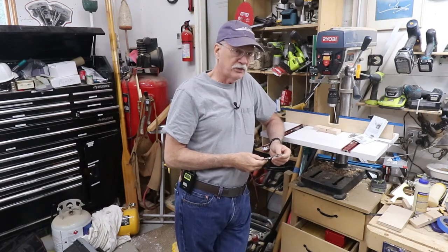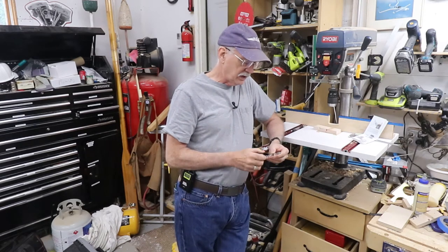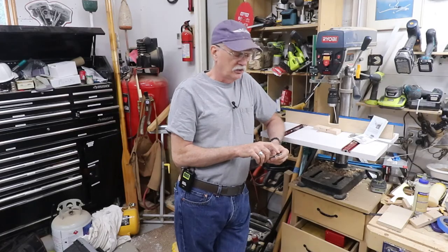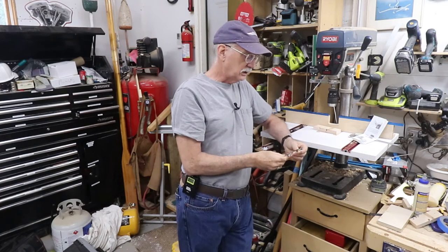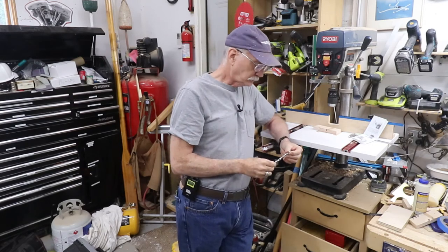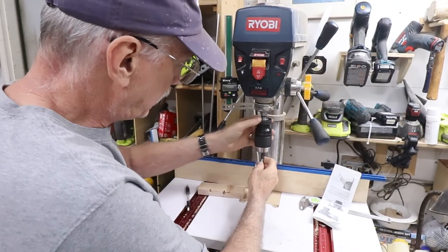Let me show you what kind of precision I'm talking about as I drill a hole. First off, I use — not a sponsor — Lee Valley brad point drill bits, and I've had this set for a gazillion years. The nice thing about Lee Valley, as you can see in this picture, is the actual distance between the center spike and the wings is flat, so it gives you a good flat bottom. The other thing I like is that on the wings themselves there's a slightly rounded cutting surface that scores the fibers before the drill starts removing material, giving a really clean entry hole with no tearout. I really like them. So let's go over here and do a quick hole drill and see how precise I can get it my first time using this thing.